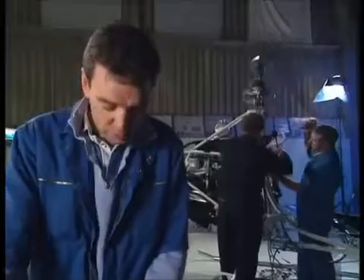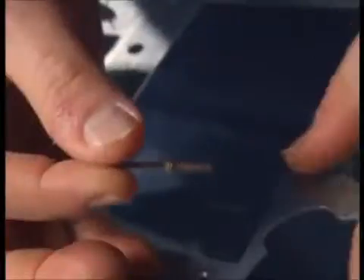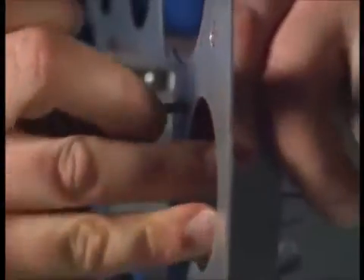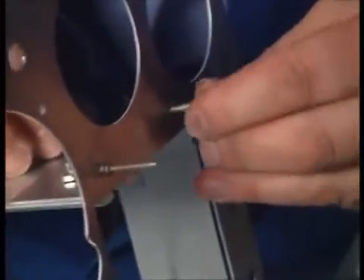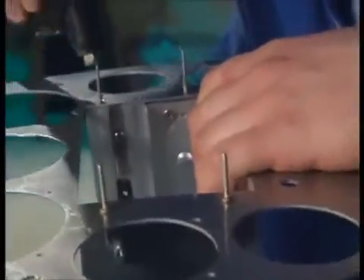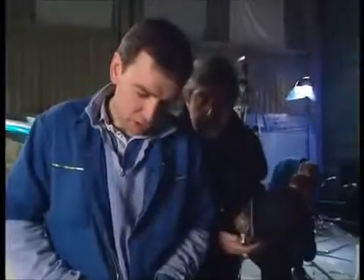This is the mounting tray for the radio and the transponder, and it needs to be pop riveted to the back of the instrument panel. Pop rivets will come through from the front, and the holes have been countersunk here. The little pop rivets are fantastic — they are actually used on the blades, and they are little countersunk pop rivets, not your average pop rivets. They will fit through the four holes. It's better to locate all four first so you know they're all going to fit. Using a standard pop rivet gun, just keep squeezing — there you go. Got a lovely finish on the front, nice and flat, which means when I put the fabric over the top you won't actually see where the pop rivets have been. One down, three to go.